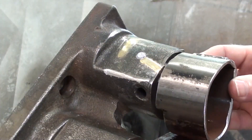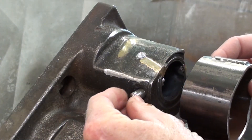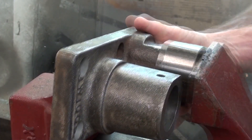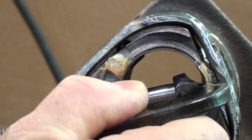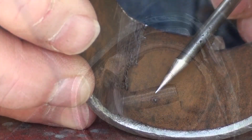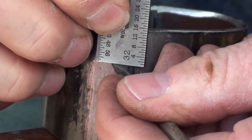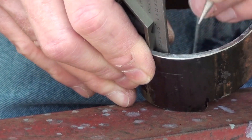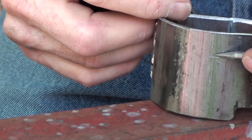I need to drill clearance holes for the set screw and the zerk fitting. I've got a set screw in there backwards and then a little drill rod with a point on it. Hopefully that'll be enough to put a mark so we know where to drill. There's the point from the drill rod, the distance to it, the center line vertically, and a little scratch mark — that's where we'll drill.